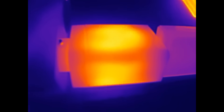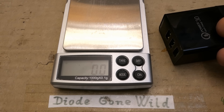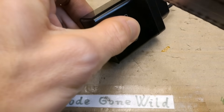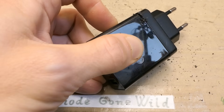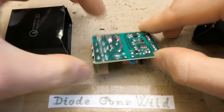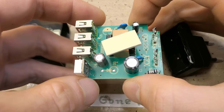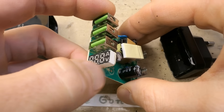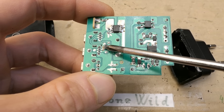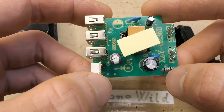Let's unwrap it and look at the internals. It's actually hotter now but not much difference. 40 grams. Here are the internals — it contains this voltmeter which just shows 5.2 volts all the time. It's not an actual voltmeter, it's just hardwired. You can see the three ports. There is actually some communication chip here, or at least a chip telling the load how much current it can draw. Can it actually change the voltages? I don't see any optocoupler here, so I guess it can't change voltages.